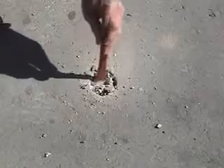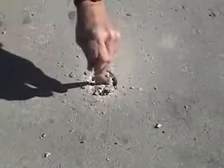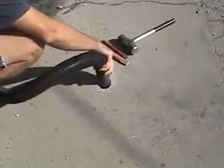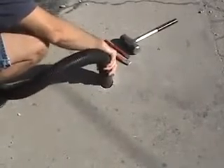Our core did not break free, but in a short time we had our core removed. It also helps to have a shop vac handy so you can get down in the hole and suck all that debris out of there — it makes the chipping go a little bit quicker and easier.